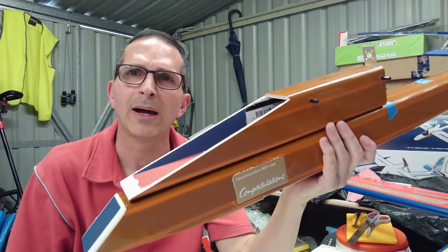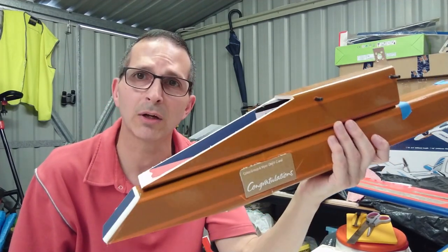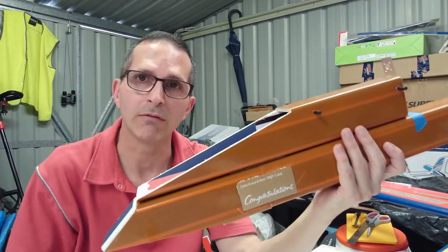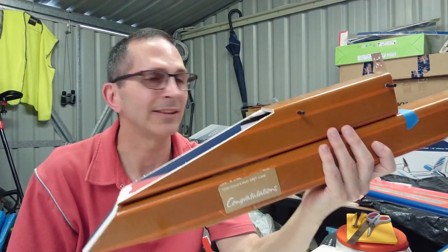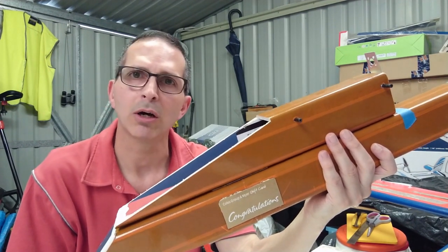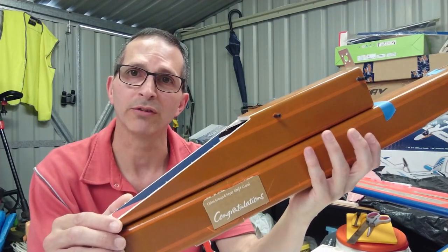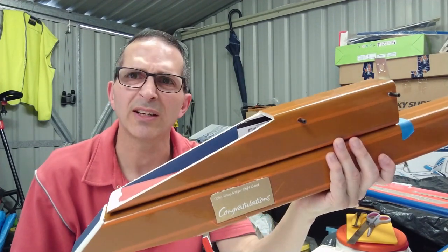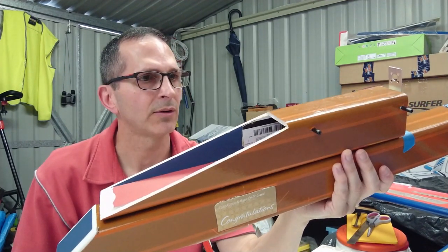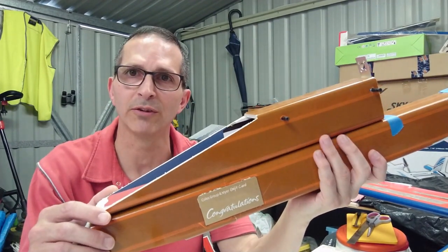So in essence, I think when I last left you, I showed you how I put together the folding wing. So this plane's now 98% complete, the whole thing, not just the wing. And at the 11th hour, I realized I've got some balancing issues. So in essence, it's too tail heavy, which I'm a bit disappointed about, I have to say. And I think that's come about because our foam board here in Australia is a lot heavier than the Dollar Tree foam board you guys use overseas. So apart from the design, apart from the adjustments I've made, I've had to make some more over and above. And I finally got the balance right with those adjustments. And I think I've improved the overall shape and design too in doing so.